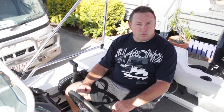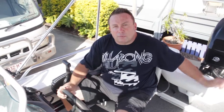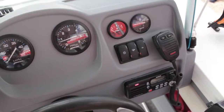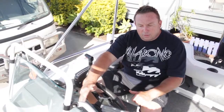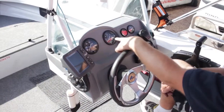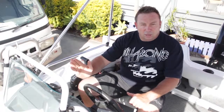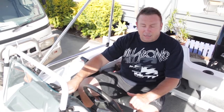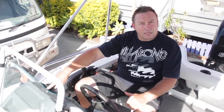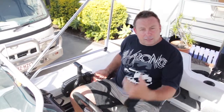Obviously we've got the steering wheel - make sure it's nice and soft and hasn't seized up as we talked about before. We've got a sounder here to tell us how deep it is under the boat. Over here we've got the speedo, we have a tacho, and we have our fuel gauge. In most boats, the fuel gauge is in a constant holding position - it flickers up and down with the surge in the fuel tank and doesn't have a delay like a car. We have the engine hour meter here. They actually work off electrical current, so if you left the key on overnight, it'd click its hours over - it doesn't work off the actual engine running.